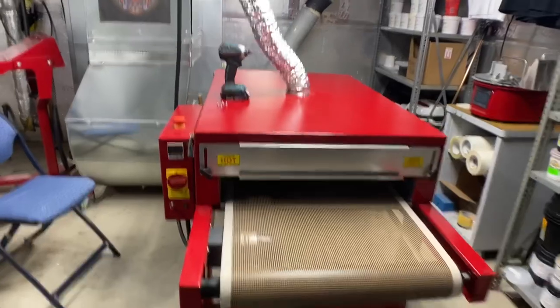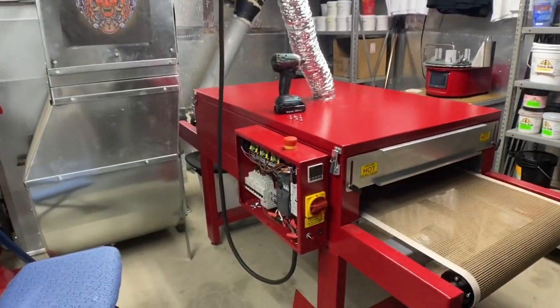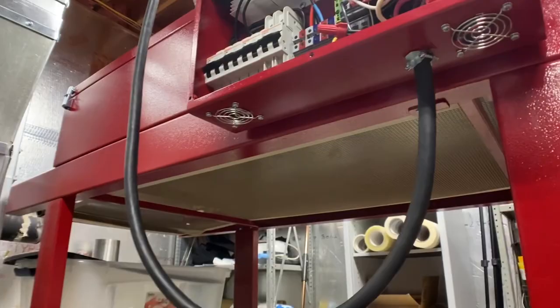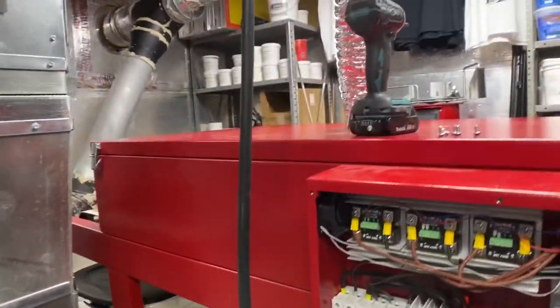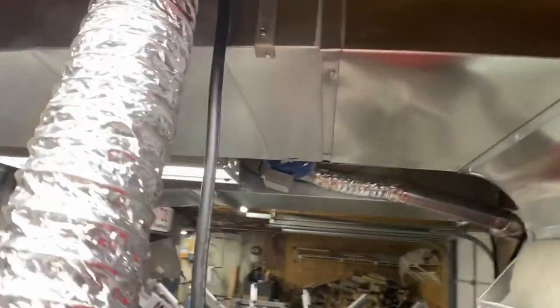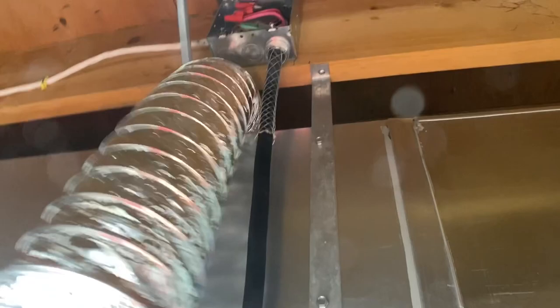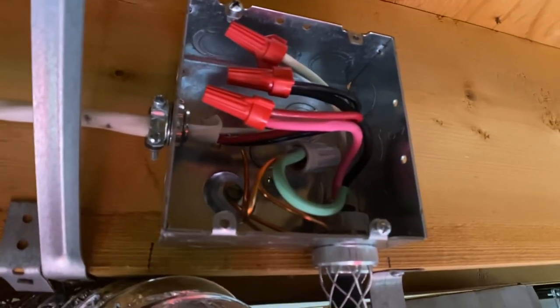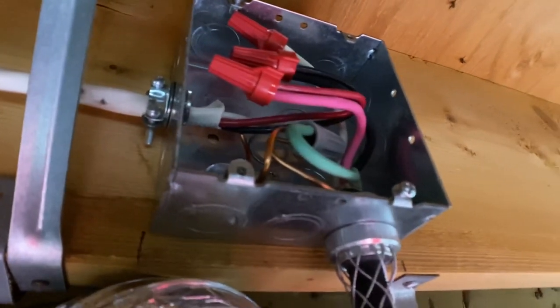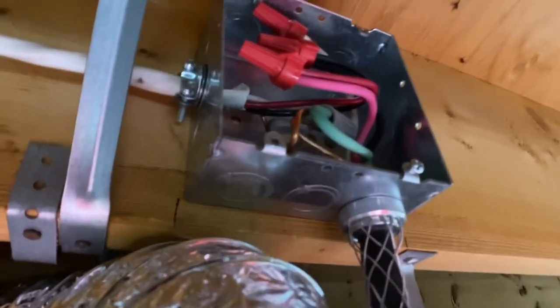Never remove this cover when the power is on — the breaker is currently shut off. Down here, the electrician installed a clamp for the flexible wire. The wire comes up through a big strain relief, kind of like a Chinese finger trap. All the wire colors go together: red to red, white to white, black to black, and then green goes to the bare copper. That all goes back to the circuit panel.